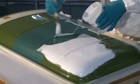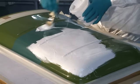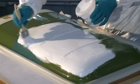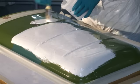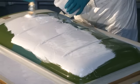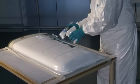The gel coat needs to be applied quickly, as once the catalyst has been added it will have a limited working life of typically between 12 and 18 minutes. Make sure you cover an area that can be worked on within this time constraint. Although the gel coat needs to be applied quickly, it should be done with reasonable care. Avoid pouring the gel coat directly onto the mould and avoid large runs or drips down the mould surface.